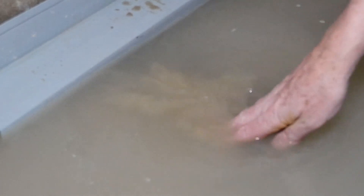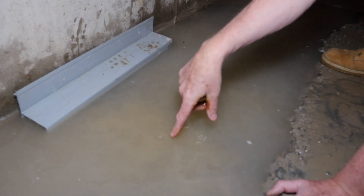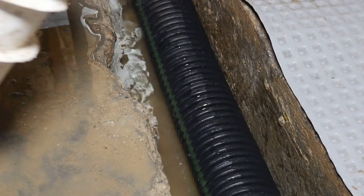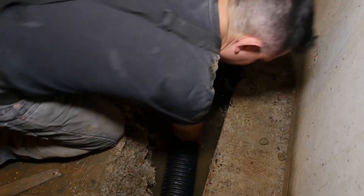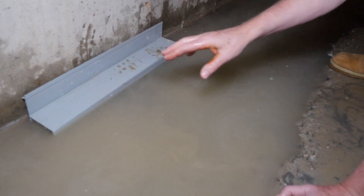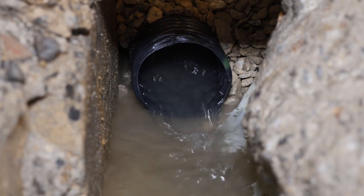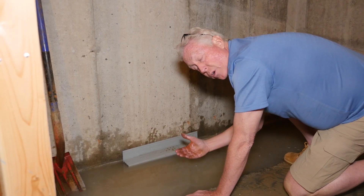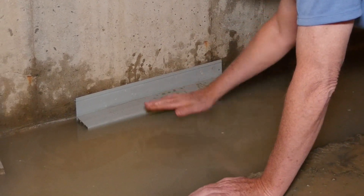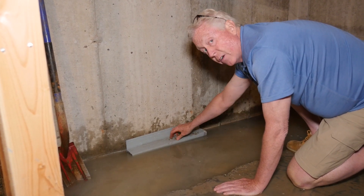We have the footing right down here — it's a nice wide footing that comes out to about here. If you were able to establish your drainage down within the depth of the footing, say we went down about 10 or 12 inches depending on how deep the footing goes, and we set up stone and pipe — a corrugated perforated pipe — pitched around to a basket, none of this water would be able to develop and fill up around your floor. We'd be managing it much much lower. Just think if you could pull the plug on this water down 10 or 12 inches — it would all drain, and you would keep that water level 10 to 12 inches below the bottom of the floor, as opposed to this type of system which manages the water within the depth of the floor. The water level has to get high enough to sit within the depth of the floor before any of it actually travels through the drainage.